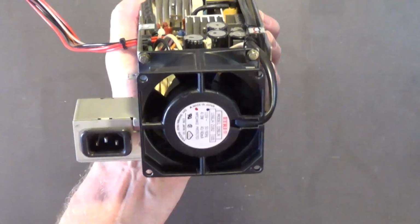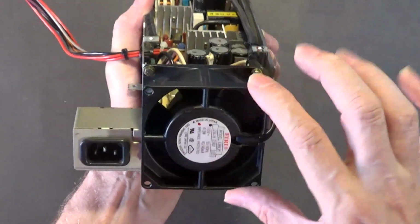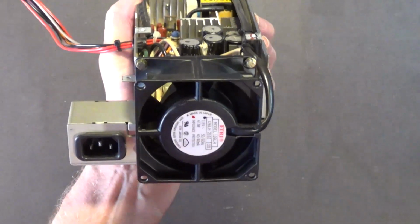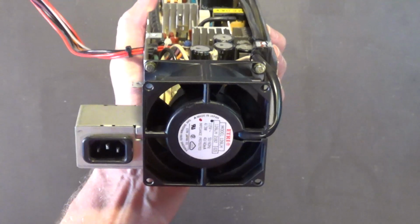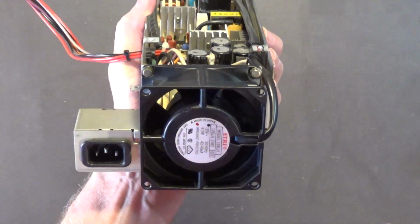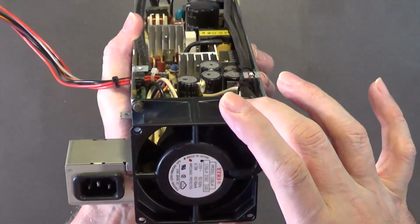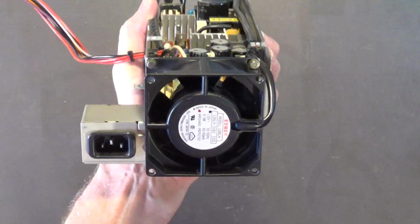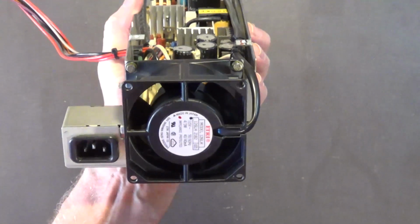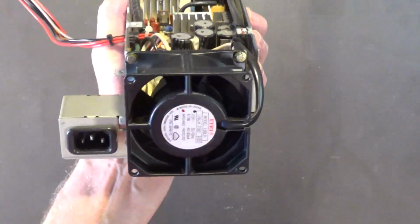That's what they are. And he actually replaced this high quality fan here, because he thought it sounded a little bit noisy, with one of those low quality Nokia fans. That was stupid. Never do that. These fans are a little noisy because they are AC fans. They're very strong, very powerful ball bearing fans. They're not going to be as quiet as today's low quality sleeve bearing garbage.